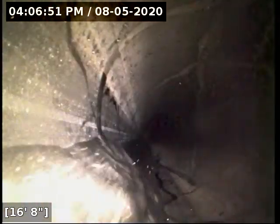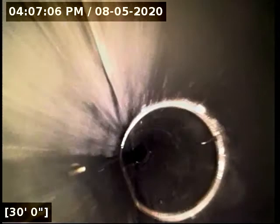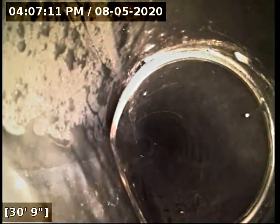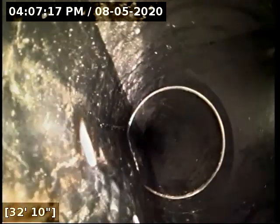So I recommend just a simple expanding cap or a flange and screw cap be put on top of it so that does not happen. Pretty simple fix, just $5-10 at the store. No big deal. But if you get a rock down inside your cleanout, all of them out there are so big they would just get stuck in the line. You're looking at thousands of dollars to dig that up. So cheap insurance to make sure something like that doesn't happen.